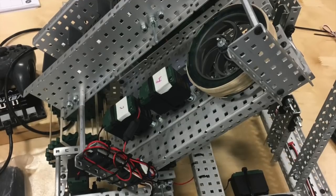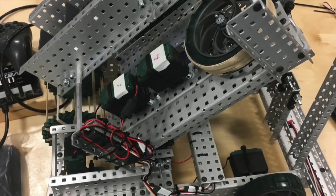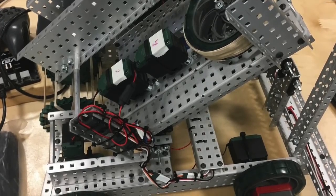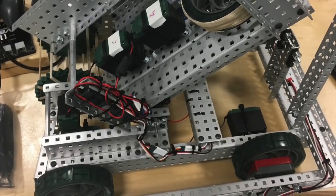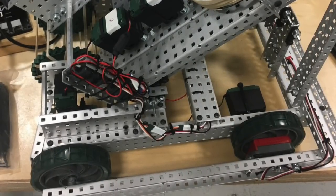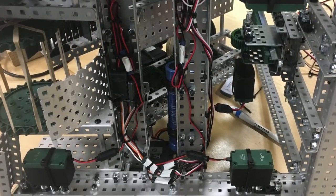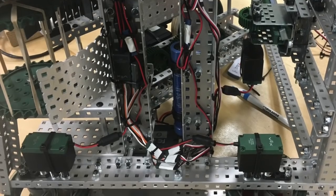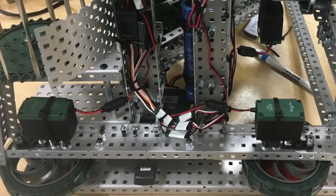The drivetrain was a four motor drive with two encoders, one on each side. The encoder wheels seemed to have a little bit more resistance than the other wheels, so if I was doing it again I would connect the encoders to the motors via a chain or other method to perhaps prevent snagging, although different mounting could perhaps remedy that issue. The robot could not get on the platforms, but that could also be fixed by lowering the wheels and perhaps adding powered wheels in the center, as another team at the competition did, and it seemed to work very well.